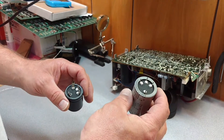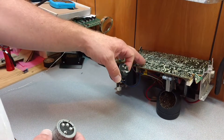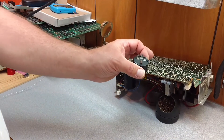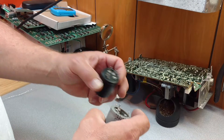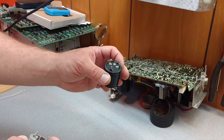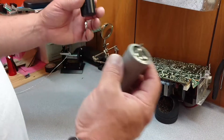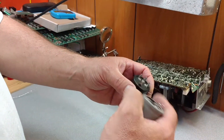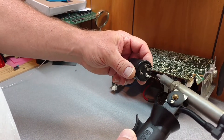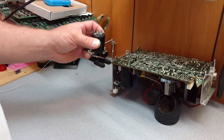These are very simple to get out — you can take your vacuum desoldering gun and pull them out. But when they have spade leads instead of pins, like this one, these can be a pain to get out. I'll show you a little trick. With pin leads you can suck the solder off all four leads and it pops right out, no problem. But you can't get the desoldering gun physically over spade leads to suck around them properly, and that's the problem people run into.